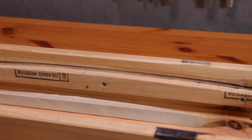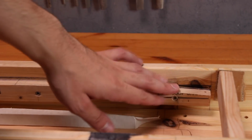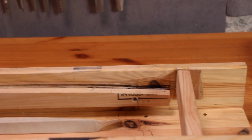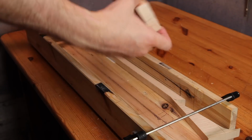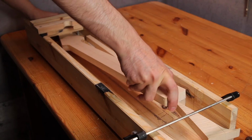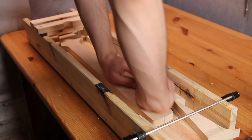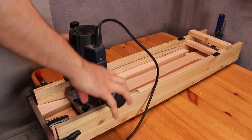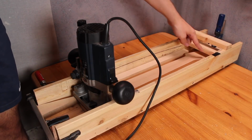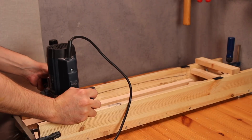And here you can see my traditional truss rod jig. I will remove this curved side and then put just a straight one, because we're going to work with a double action truss rod. So it's way easier for the people that have a fear of this thing. A traditional truss rod is always a very hard job to do compared to a normal truss rod.